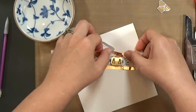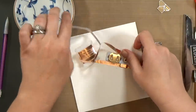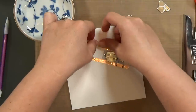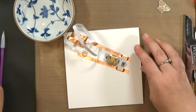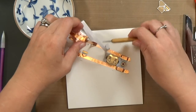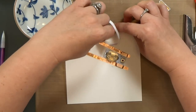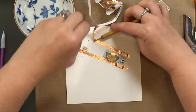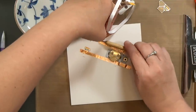Again I've got a little bit of a tail with my copper tape hanging off one side of the power pack. Then I'm going to come up and you can curve this tape. This tape has conductive adhesive, so you can tear it and stick it back to itself. But every time you do that you add a little resistance to the line — it's best if you just bend or curve your tape.